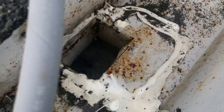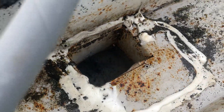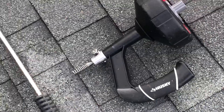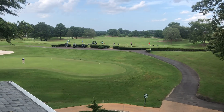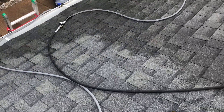I could not get it to unclog even with a high-pressure tip. I stuck a high-pressure tip in there with a lance — you can see the lance on the pressure gun right there — but I couldn't get far enough with a straight lance. My next resort was to get a plumbing snake from Home Depot or Lowe's. I proceeded to snake the drain and it would not budge, would not break the clog.